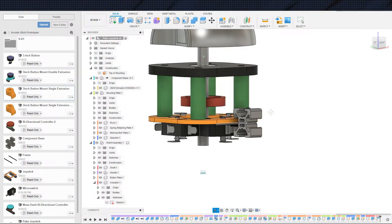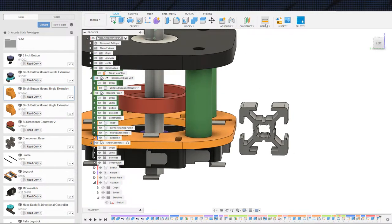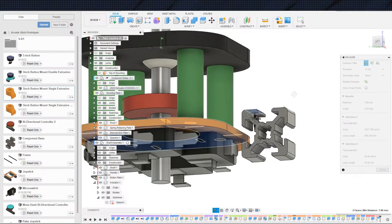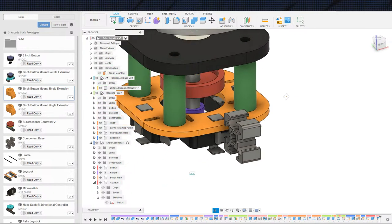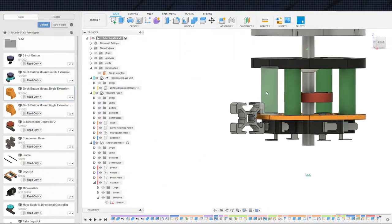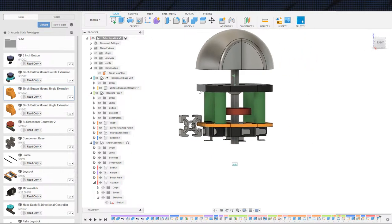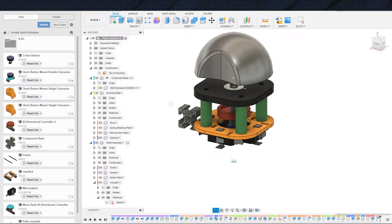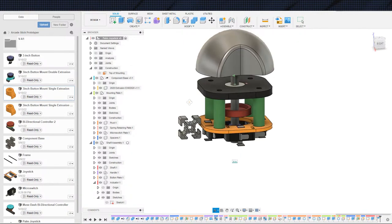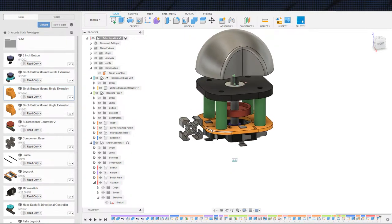It's one of these things where we could, in theory, raise it up a little bit. This distance right here is, what, maybe 6 millimeters? 8 millimeters? All right, I'm off by 2 millimeters. Whichever. So we could, in theory, just lift this whole entire thing up by 8 millimeters and have it flush with the extrusion to keep it simple. The only reason I may not want to do that: there's two reasons. One, we're going to have to cut out 4 of these slots here so that we still have access to them.